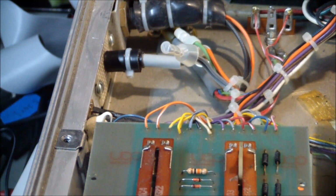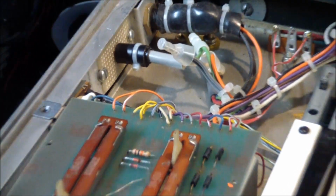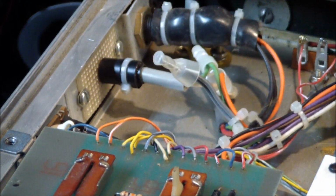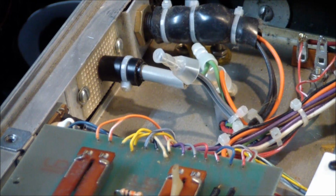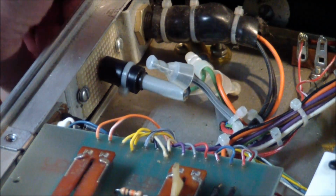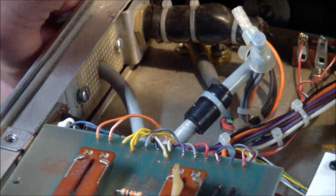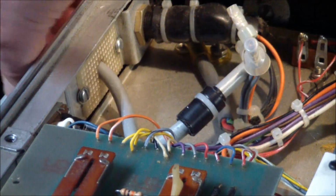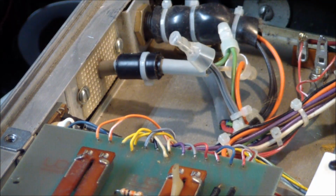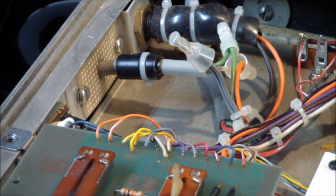I really can't tell if this is factory or not, but what seems to be a dead giveaway is, look at the plate that's holding the power cord in place. It looks like a piece of proto board. So I'm not sure why that was replaced or why somebody would do something like that. Because especially, it's not that portable anymore. You can't shove the power cord all the way in. It'll go in part way, but it'll take quite some calisthenics to push it all in. And then, of course, the plug will still be sitting outside. So I really don't know. What I was planning on doing is fixing that, basically see if I can replace this part with just an IEC socket, and then just use a regular IEC cord that could go into here.